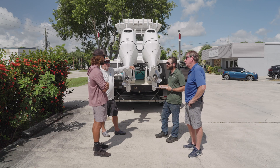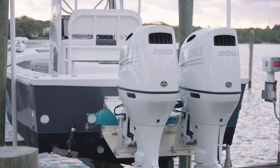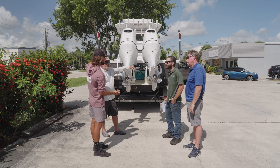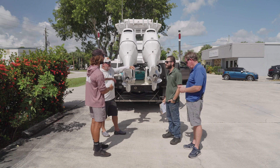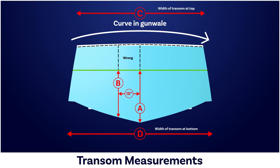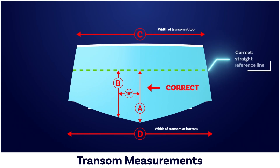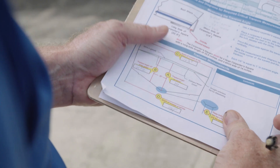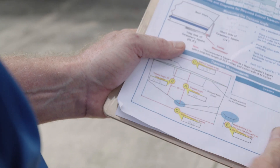Adam was confused because he has a slight crown on his transom with a cap above it, and wasn't sure whether to measure from the cap down or just below it. The key is to draw a straight reference line and take A and B measurements from there. The actual height of the reference line doesn't matter as much as the discrepancy between the two measurements — that difference is how dead rise is calculated.